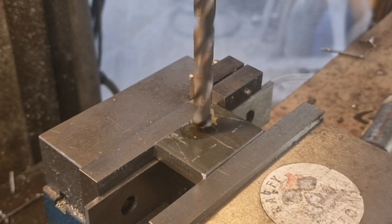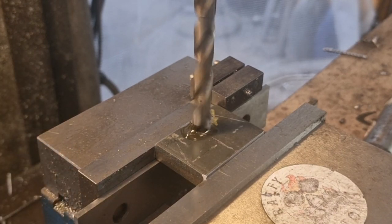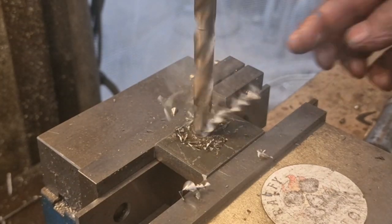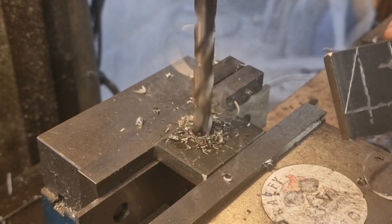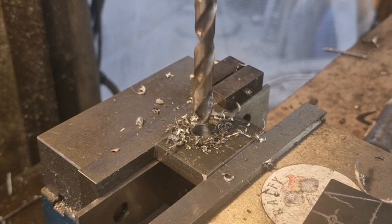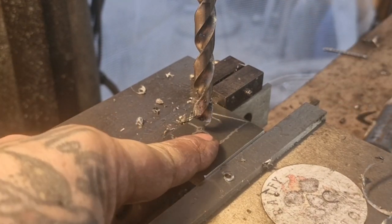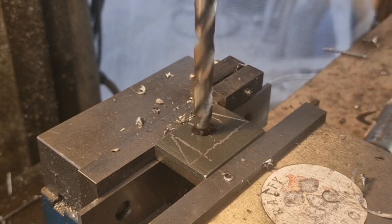I have left one inch at the top and come half an inch from the bottom, so where those lines meet the edges I will cut the corners off after I've drilled it. So we'll end up with a little triangle with a 10mm hole in it. Here we go — I've got my stop in place so I can put the other one in and just drill straight down without having to reposition it. I'll just swap them over. Fucking happy days — swap them over, making sure there's no chips interfering with it. Nip it up. Sorted. Happy days.